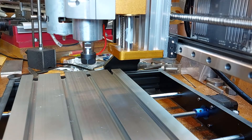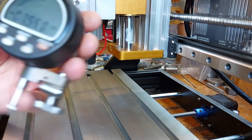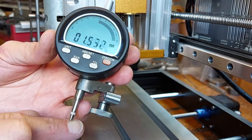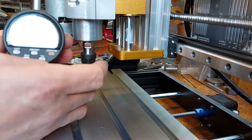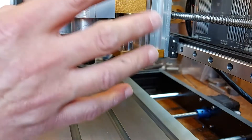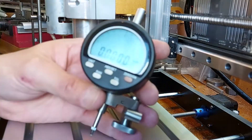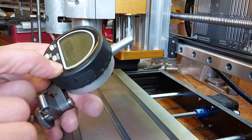The obvious way to set up a milling machine or a CNC and make sure the head's square and the table's flat is to use a DTI. You get a plunger and can see exactly where that plunger, when it gets pushed in or pulled out, how high is the height above the surface. You'd fix that to an arm and fix that to the spindle and turn it around. The trouble is, this is rather big compared to the size of this tiny CNC and it's really difficult to fit this on and do the measurements where you swing it back to front and side to side. It's just too clumsy a device for this, so we need something else.